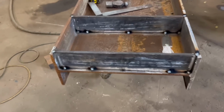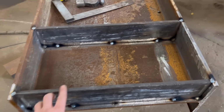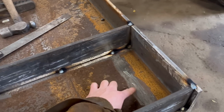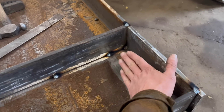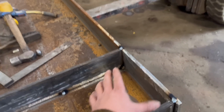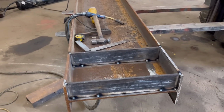So I've got them braces cut, well, tacked in, so that's 100x12. Then I'll do the same at the other side, and then I'm also going to put a bit on its edge like that, or on a diagonal from there to there, so that should box that in and strengthen all that lot up. So I'm going to weld all that round now.